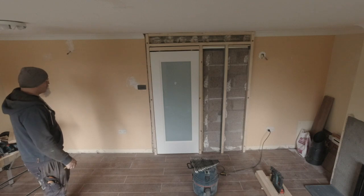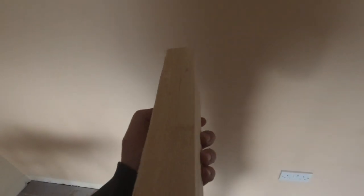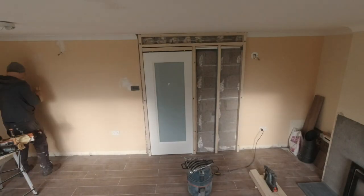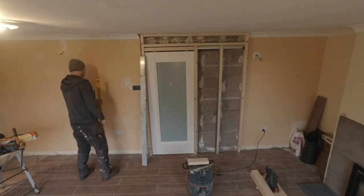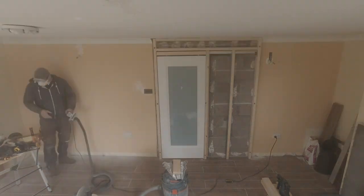I've marked out 40 centimetres from each of the outside walls. The way I'm doing this is I have this 4x2 cut off. I make a mark here and one on the other side, just aligning the flat of the pencil with the flat of the 4x2. That gives me a few millimetres of tolerance so that I don't end up with a cut-out that's potentially a little too narrow. I repeat this marking of all the stud positions, then draw lines again with the spirit level to ensure straight, plumb marks.